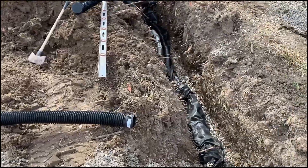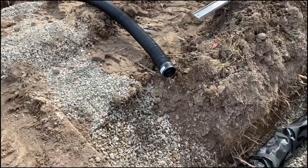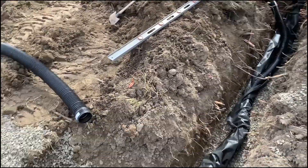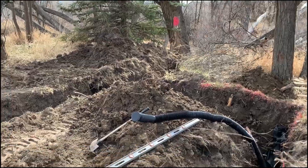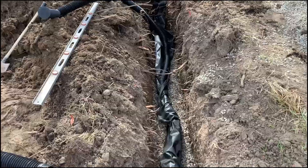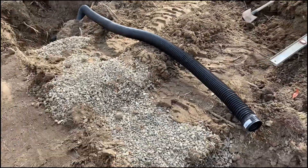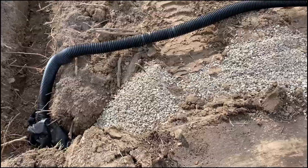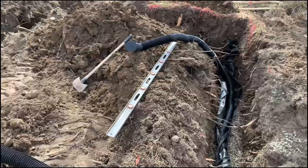Just fine-tuning the bottom of my rubble trench. The idea here is that the bottom of the trench is level all the way around. It is at its shallowest point 32 inches deep, about 42 inches in the back, so we're well below frost line for the area. Laying in this perforated French drain, wrapping it with landscape cloth, and then we'll backfill and tamp with gravel until we come up to grade. Then I will pour a reinforced bond beam on top of that, which will be the foundation for the timber frame bathhouse.